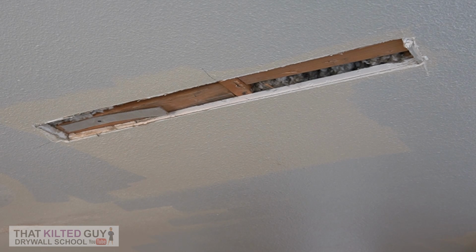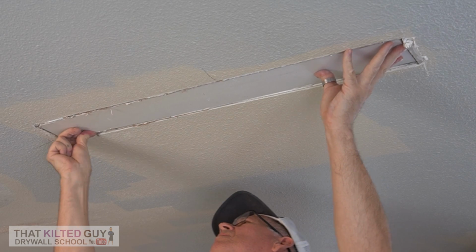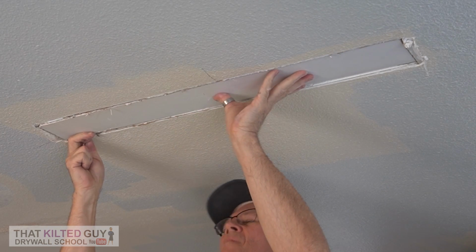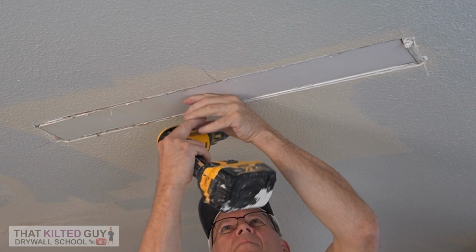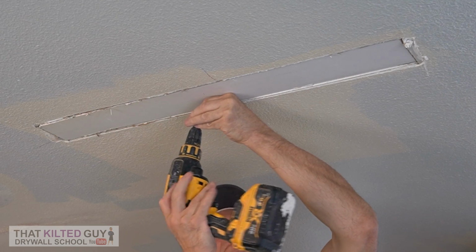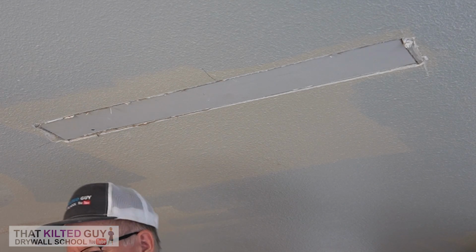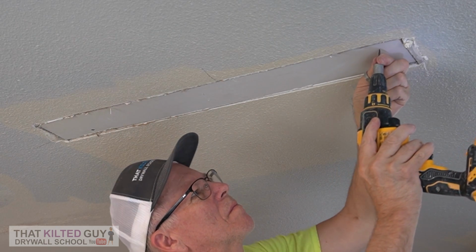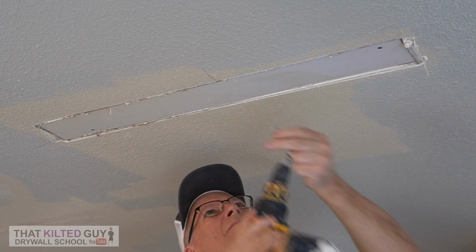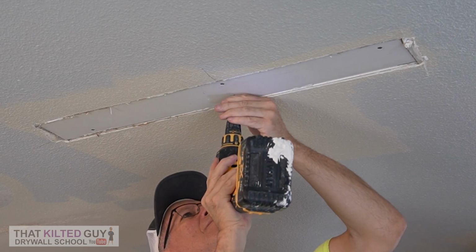Then I'll attach it with some drywall screws, and here I'm using my drywall cordless screw gun. It's not a cordless drill, so this one doesn't turn until you push on it. You can get by just fine with a cordless drill, impact, whatever you got. It's best if you can put a sinking bit tip on it. I'll show you a picture of that here. But in this case, I just put in 4 screws as it's really solid. So now we're ready to apply the mesh tape.